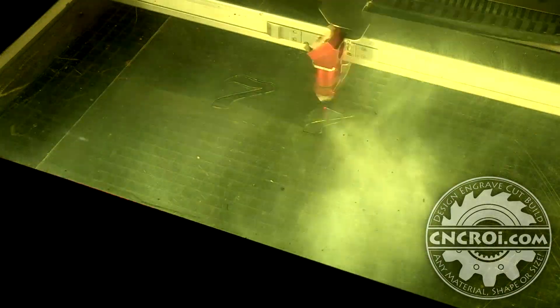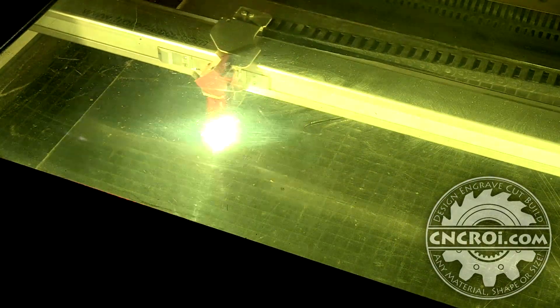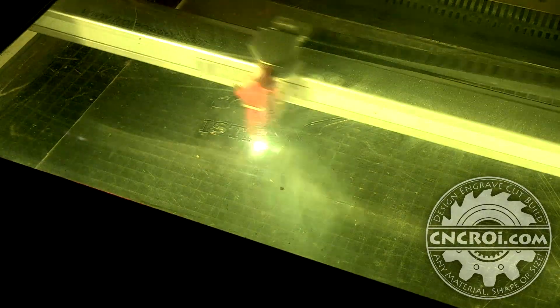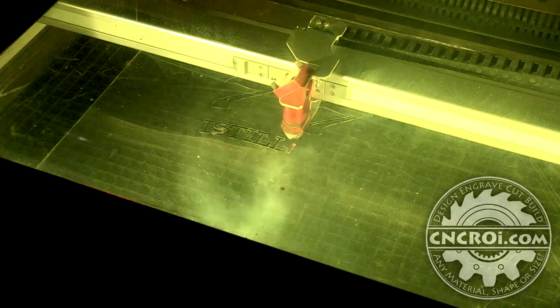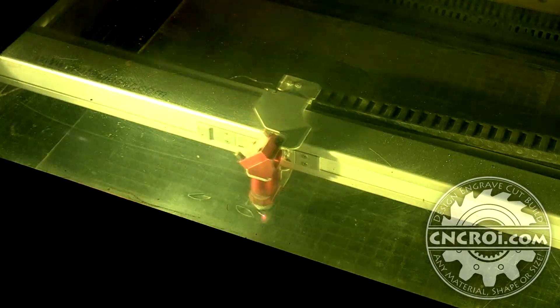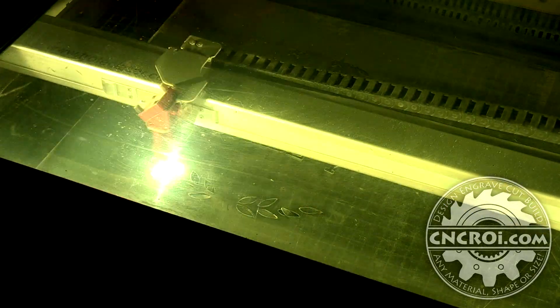When it comes to laser cutting mylar or polycarbonate, what can actually go wrong? There's actually not that much. The polycarbonate I'm cutting here is very, very thin, and as a result it's not really flammable compared to acrylic — with acrylic there's always a flame somewhere. The other thing that helps is there's a lot of air power coming out of the head, pushing down, so if there happens to be a flame it's extinguished almost immediately.